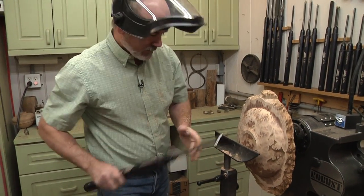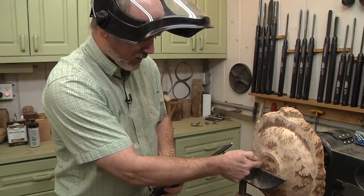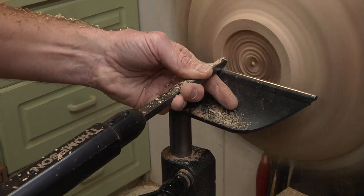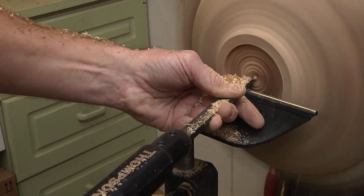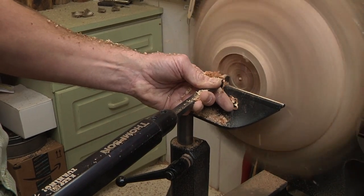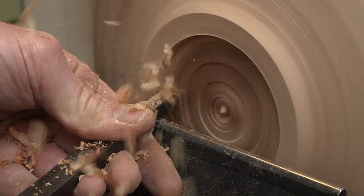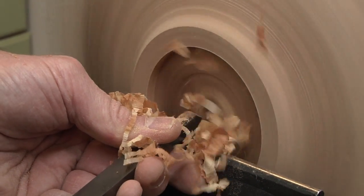This is my little tenon tool that I made a while back. We're going to put in our recess there for our tenon — a little dovetail. This just goes in flat and you push, then you can't take the whole cut at once. I've got my angle going for the tenon and I'm able to come across and start scraping a bit, cleaning up the bottom. This is such hard wood — you want to leave the best tool finish you can on it because it's really hard to sand out any imperfections. Then I'll sand it and we'll be ready to turn around and start hollowing out the top side.